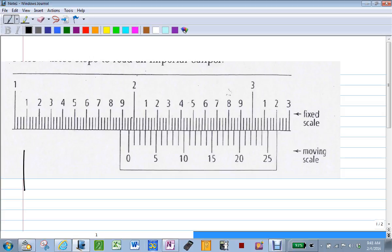All right, now this is weird. That is a half, right? Half the way between 0.9 and 1. Yeah? So what is that? These are tenths. But they've been divided into 4 chunks, yeah? So what's a tenth divided by 4? Pardon? 1/10 divided by 4. 1/10 times 1/4 is what? If you need to go to your calculator, you can go to your calculator. 1/40, yeah?